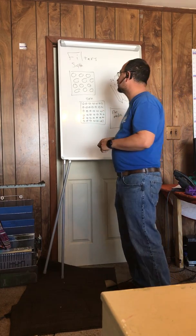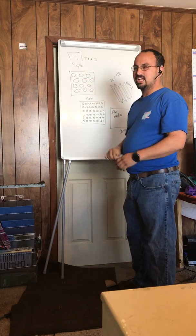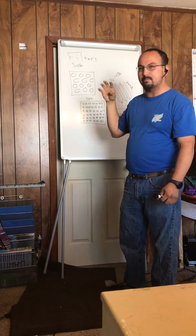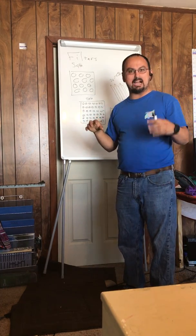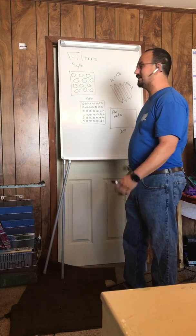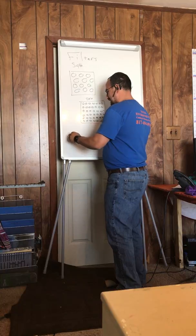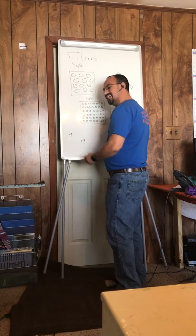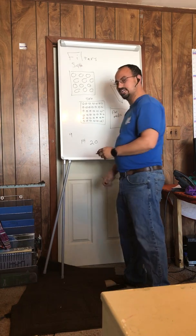The very first thing that sort of happened is we started out with this fiberglass stuff, and you could pretty much shake sand through it. It wasn't that great, but it kept bugs out. Back in 1985, we just needed to keep bugs and mice and stuff out. But as the efficiency went up, our coils went from something like 9 fins per inch to like 14 fins, and I think we're in the neighborhood of almost 20 fins per inch.